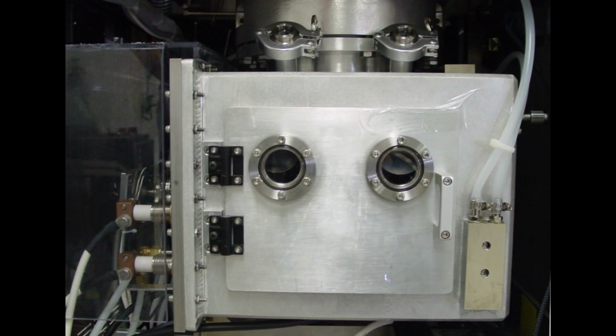The load lock chamber is located below process chamber, isolated with pneumatically controlled gate valve to keep the evaporator pockets under vacuum during substrate loading and unloading to the process chamber. It consists of E-beam source module mounted on the side flange with rails for easy service, a front door for loading materials to pockets, and viewing windows to optimize beam spot and scan in a pocket.